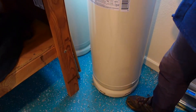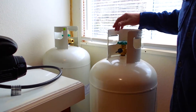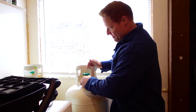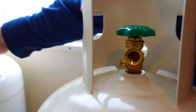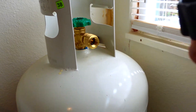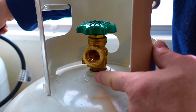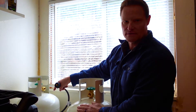I also invested in two 100-pound propane tanks as mobile backup - they actually hold 80 pounds of propane each due to the 20% expansion rule. These have a different thread pattern than standard fittings, so I bought a converter adapter screwed in that allows you to use a normal propane fitting. Just be advised: when you get these tanks, make sure you get the adapter before you actually need to use them.